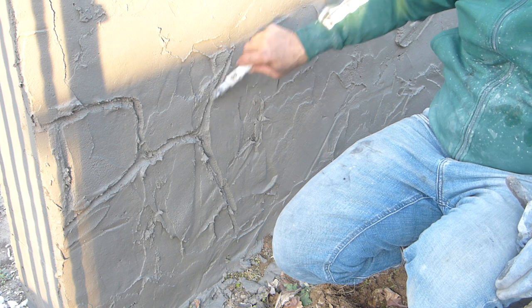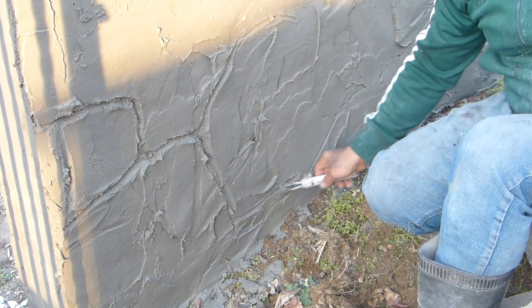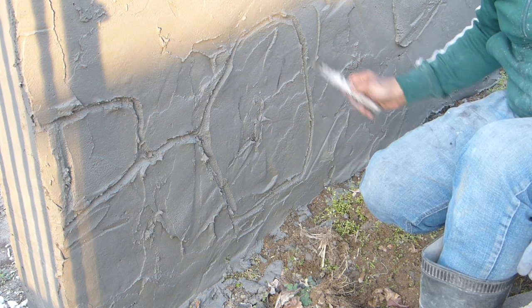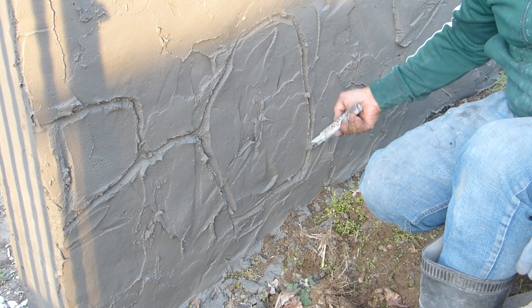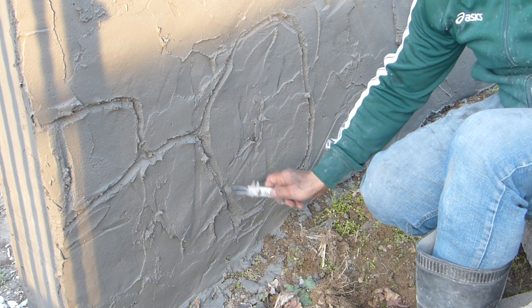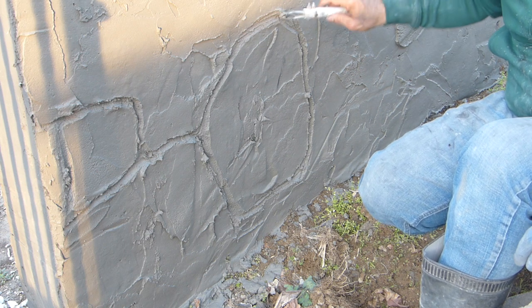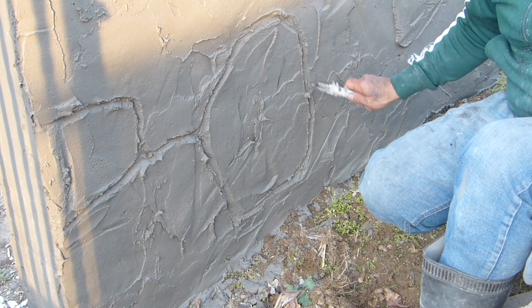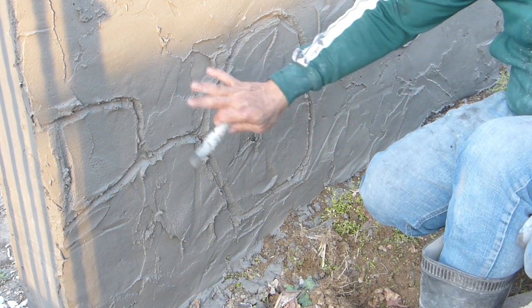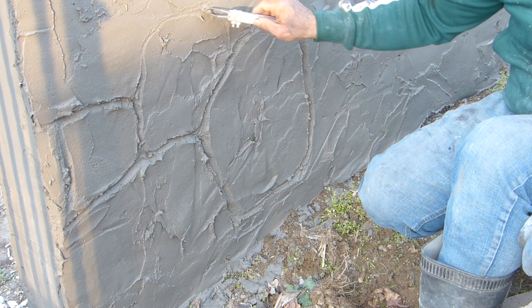These would overlap — the stone could come down to here and this one can come up to there, sort of like that. I'm going to end the video segment here because it's nothing to be carving yet. Don't forget to waggle it a bit and cut the corners off. The joints shouldn't be too consistent — widen it up here and maybe on this side too, so when I put the white mortar in it looks like a wider joint. Stagger your joints and lightly outline each stone. I like that.